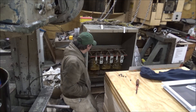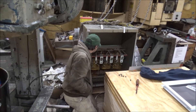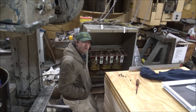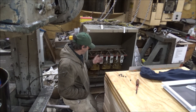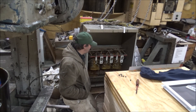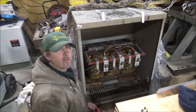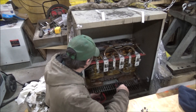Actually, looking at it more carefully, I think it is aluminum — it's just got varnish over it that makes it look coppery. I'm pretty sure it's aluminum because it looks like they just tack-welded the lugs on here. But this thing is full of garbage, so my first order of business is to vacuum it out. Then I'll take a meter and check it to see if anything shows continuity between any of the windings and ground.